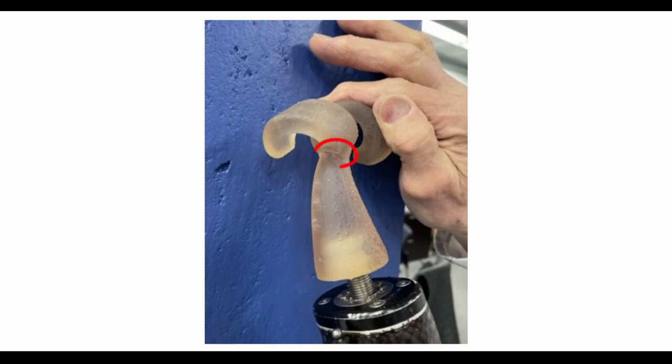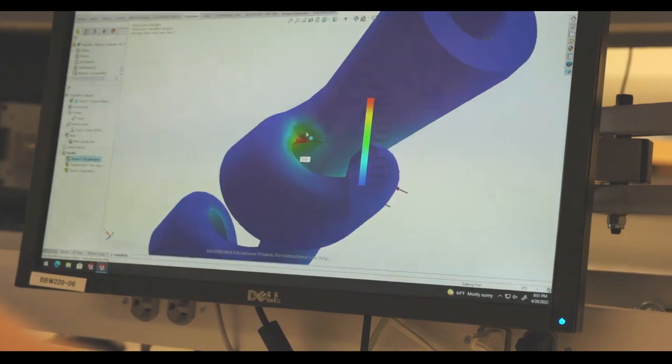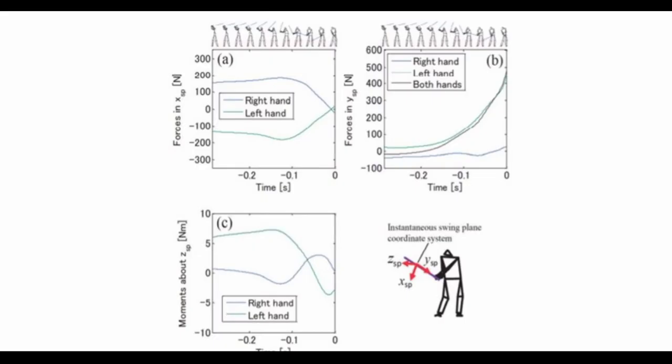With our sixth iteration of the Golf Helix, which we felt pretty confident about, we invited Bob to come down and test it at the Varsity Golf Studio. We were excited at first because things were working pretty well, but then we noticed a tear in the Helix, which, looking long-term, would not be good for the durability of the product. We decided to run a SolidWorks finite element analysis, using data from a study on forces involved in the hand during a golf swing. The results matched our physical testing almost directly — there were stress concentrations exactly where those tears occurred, helping us figure out how to address those issues and move toward a better Helix.